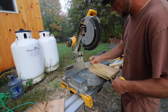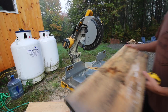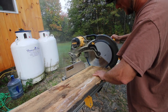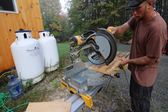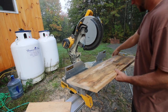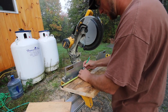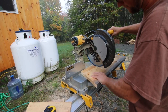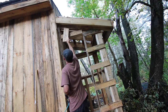So that means the one after is going to be nine and seven-eighths to the long point. I'll flip it around — being a longer board, it says nine and seven-eighths to the long point. Same thing, flip it over, boom — let's get our first two boards installed.